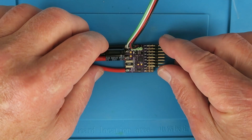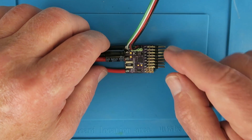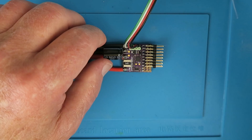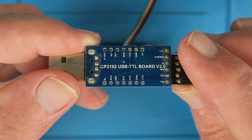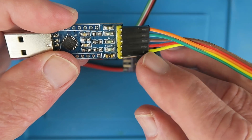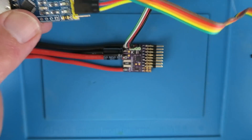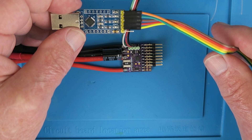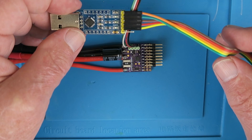The first thing I'm going to do is connect it up to my laptop and use the command line interface — the CLI — to check the version of the board, upgrade it if necessary, and see if there are any other parameters. For that, we're going to need one of these little guys. This is known as a CP2102 USB to TTL board. It has little LEDs to indicate the status, and we only need the four wires at the end: receive, transmit, power, and ground. Again, remember to swap the receive and transmit pins, otherwise it's not going to talk.